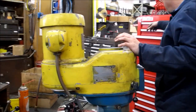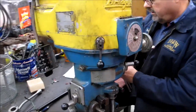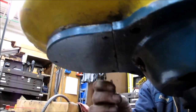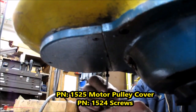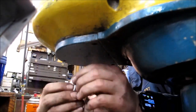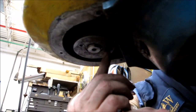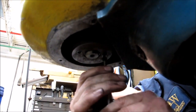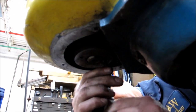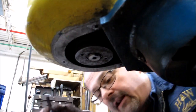Next we are going to take the bottom cap underneath the motor. There are three socket head cap screws holding it on — a five thirty-second allen wrench. You will not discard these screws; you're going to be using two of them. Two of these screws go into holes in the bottom of your pulley. In a perfect world you'd thread them up and tighten them to compress your spring, but this disc is completely sprung so they will not fit. In this case we are going to have to do it the old fashioned way.